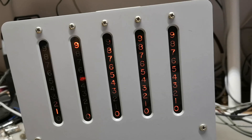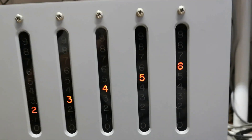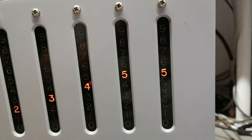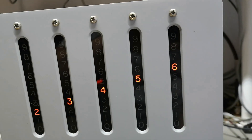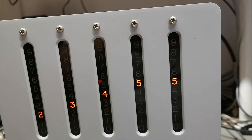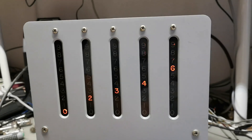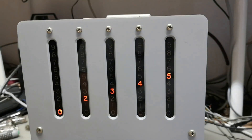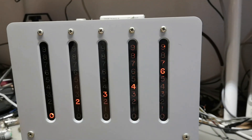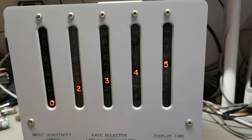What I'm going to do is go a factor of 10 down — so instead of 100, I'll go down one step. See what happens now — I go a factor of 10 down and now all the neon bulbs work. So that is just a display thing; the neon bulbs simply can't light up that fast. So that was a trick — nothing wrong with the counter.